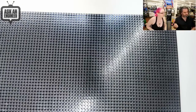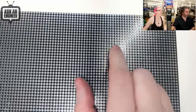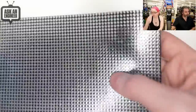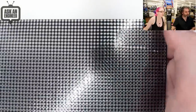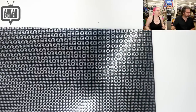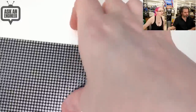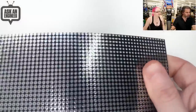Does the flex board have solderable holes? Yes, you can solder these holes. They're not silver plated, they're tin plated holes. So you would put your components through here as if it was a normal breadboard, and then solder to it. Flexible perma-proto, almost. Yeah, we have a flexible perma-proto, which is actually made out of flex material, but flex material is just pricey compared to something very thin. This you can cut. It's a circuit board, and this is good enough for most projects. So I think for cosplay and wearables especially, this would be super handy.